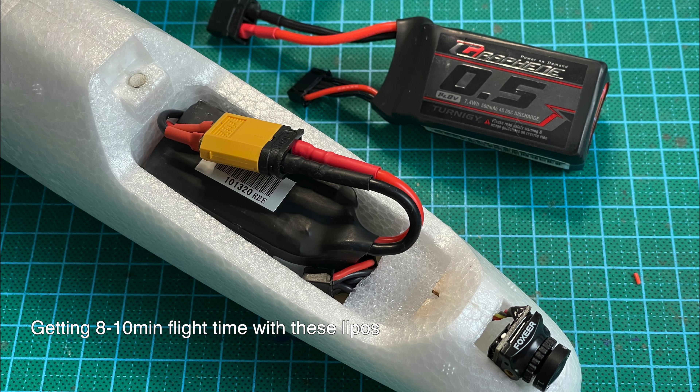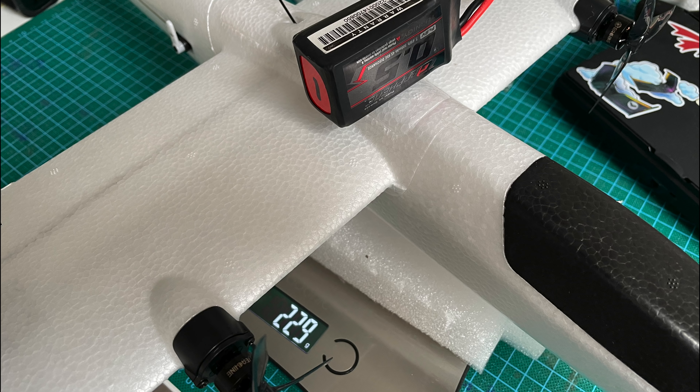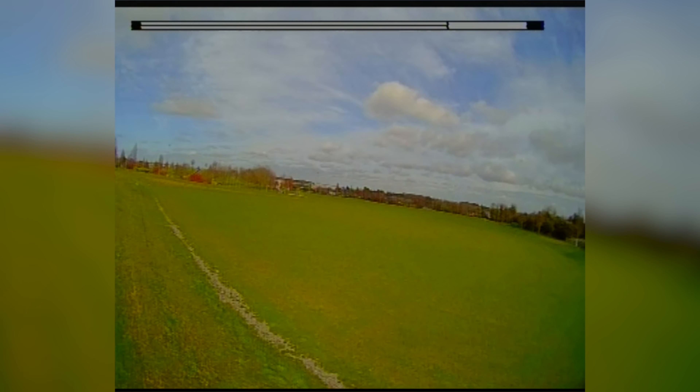My specific setup: in the analog gear rear bay I installed a six-channel Crossfire Nano receiver, the PWM version, so you can plug servo connectors directly into it. In the front battery bay I used a 500mAh 4S LiPo — the only one I had that would fit, but it actually works quite well. The battery weighs around 68 grams and I had to push it right back to get CG. I also replaced the linear VTX antenna with a circular polarized one I had, since my receiver antennas are all circular polarized. The all-up weight of the analog setup was 229 grams.